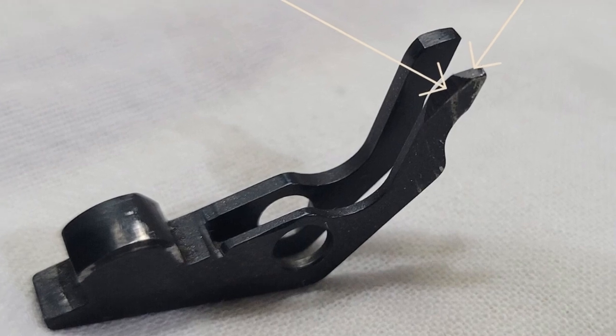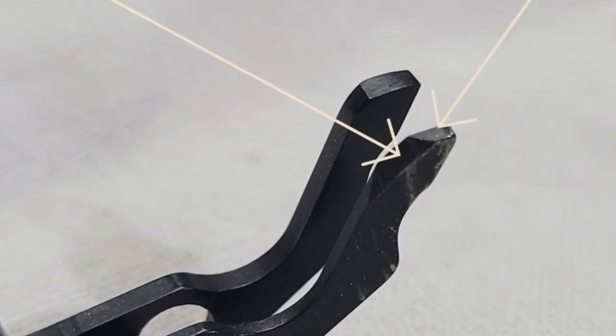To fix this problem, all you need is a little bit of fine sandpaper glued down onto a small wooden block — a two-inch by two-inch block is all you need. It's going to be a tedious process of taking off a little metal, putting your revolver back together, testing, taking it apart, and repeating. You're going to remove metal on the angle cut at about 30 degrees and a little bit off the top. I recommend just doing about 10 light strokes at a time, keeping everything true to the factory angles. You'll notice that the cylinder gap gets less and less until it falls into place. Be careful not to remove too much metal — if you do, you'll have under travel and there's nothing you can do except buy a new piece.